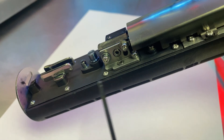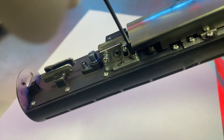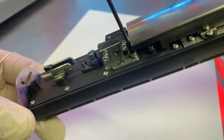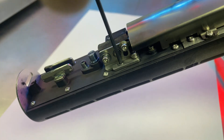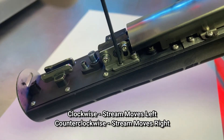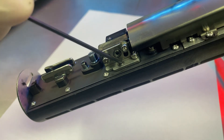If we need to make a horizontal adjustment to our alignment, it's basically identical hardware to our vertical, just in a different location. Our set screw for horizontal is right here — all you do is loosen that up a little bit. And then our eccentric wheel is right here. Counterclockwise will actually move the stream to the right if you're looking at the printhead from the front; clockwise will move it to the left.